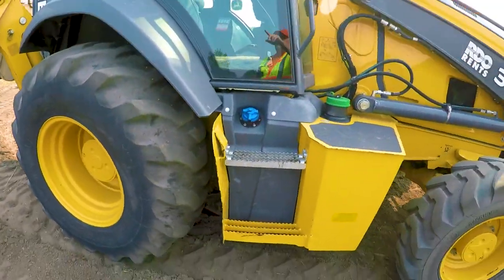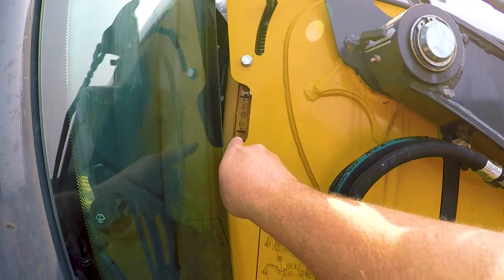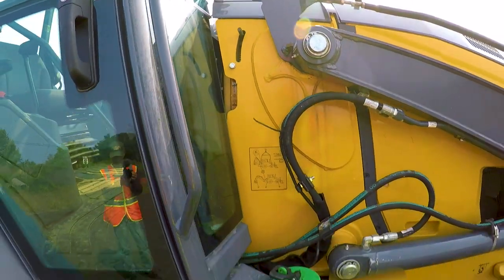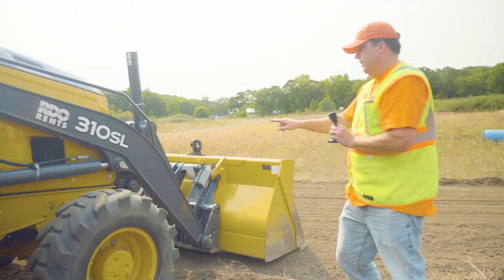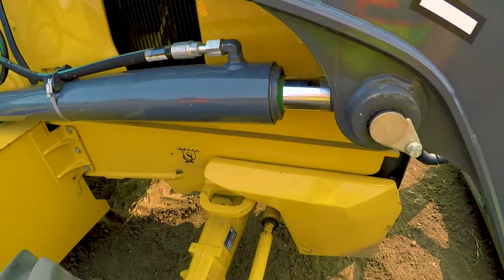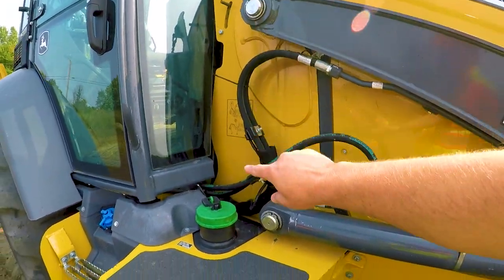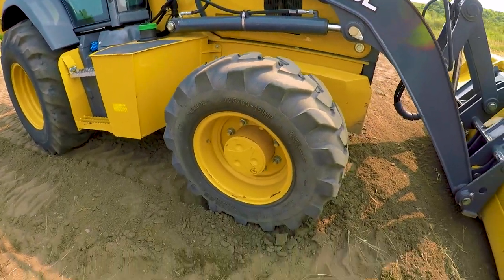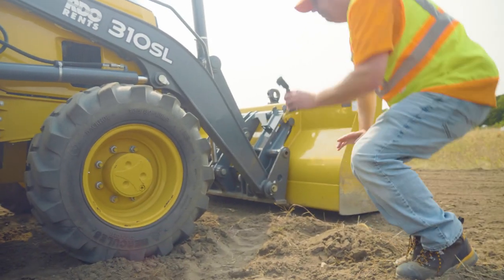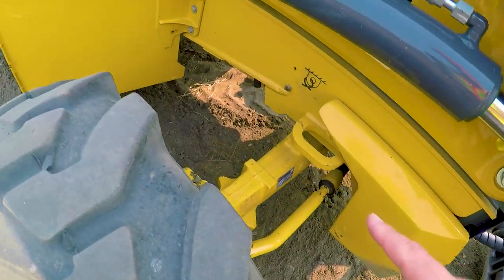Obviously you want to make sure your mirrors are intact. When on this side of the equipment, this is actually where you check the hydraulic fluid — the level should read between those two lines. Continuing around the front, checking the cylinders — if you were to see any leaks around the seal on any of the cylinders, you're looking for that. Same thing with all of these hydraulic lines — it's just a quick glance over. Front tire: checking for any damage, looks properly inflated, lug nuts are all on. On the inside, making sure everything looks secure.